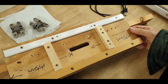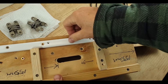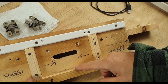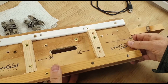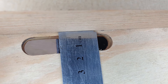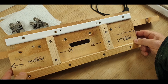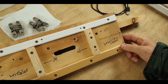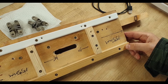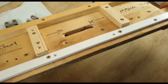In order to set these hinges, rather than buy one I've made a jig. It does look rough, but this is literally out of scrap — a bit of uPVC window trim, a couple of stops, and then that's the width of my little router that I'm going to be using. The important bit was that gap there, because the existing hinges are only set about three mil from the edge.